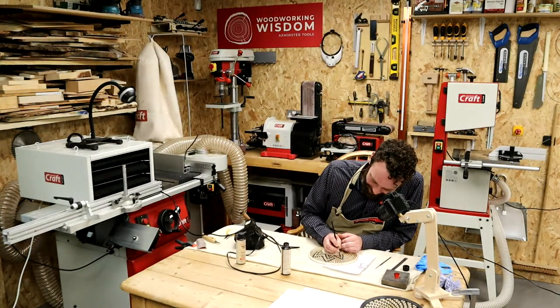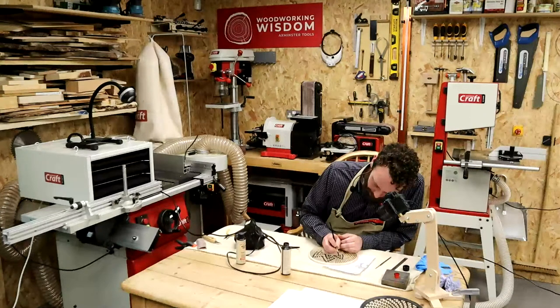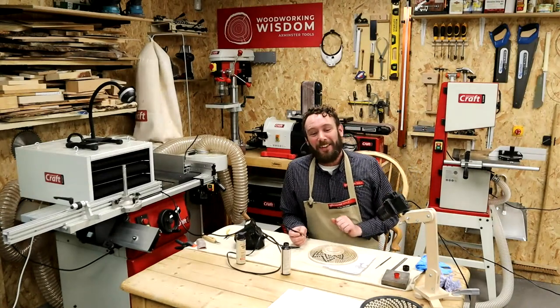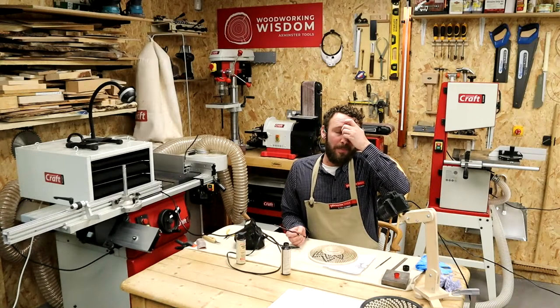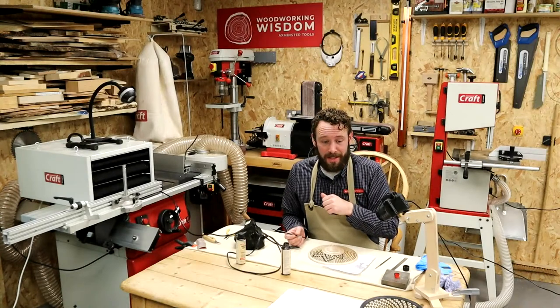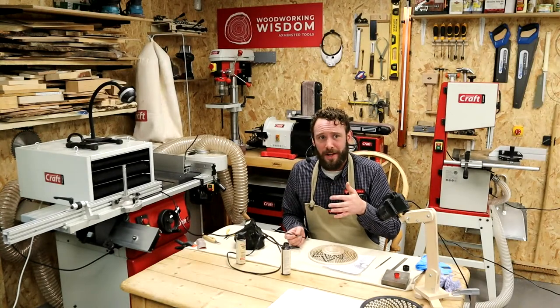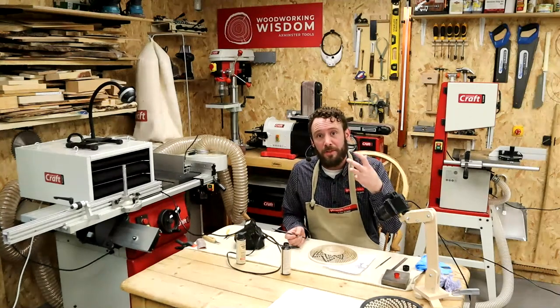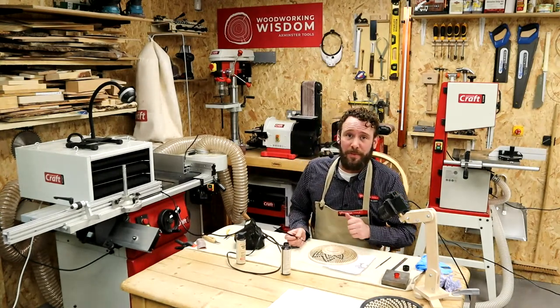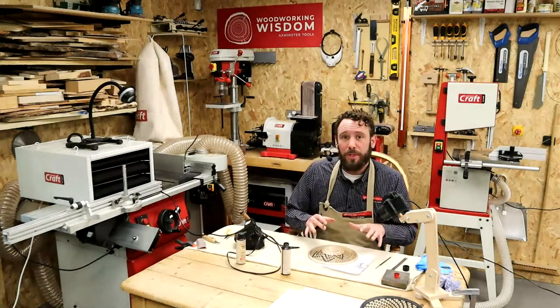I've got a question here from Maria in Wales. Hi, Maria. How long would you leave the dye to dry for before applying the oil? Generally, I'd like to leave them 24 hours. But sometimes we've got a demo the next day and we want to show this thing. So that one, actually, I painted it. Because it's a spirit stain, that spirit evaporates really quickly. And I just put the oil straight on there, to be honest. Might have had about half an hour's time to relax and allow the dyes to evaporate. But yeah, I went straight in with the oil on the back of that one. It didn't seem to affect it too much. It didn't pick anything up and wash it around.